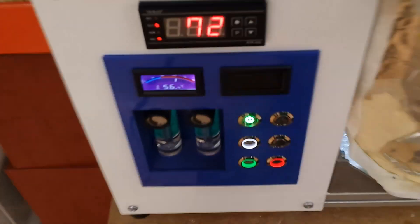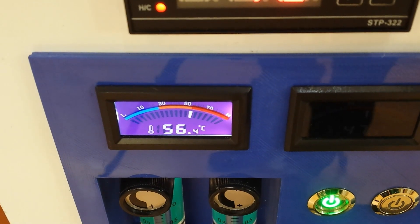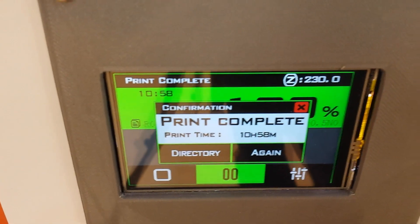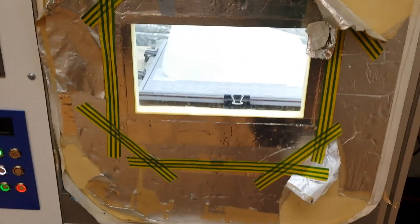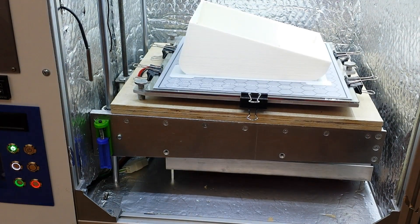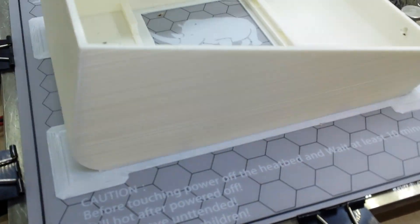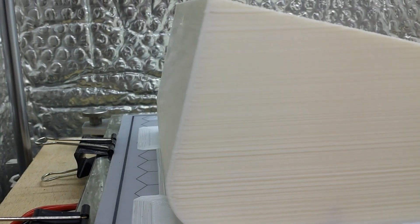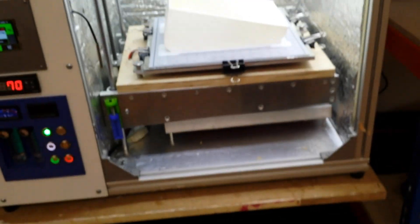My printer has just finished its first print with the new heater. The ambient temperature in the chamber is about 56°C, the heat mat is at 72°C, and it finished in 10 hours and 58 minutes. Let's see if there's any improvement. I'm still over-extruding at the moment until I'm more confident this is working fine, so there are quite a few layer lines — but what there isn't is any splits. Not one.